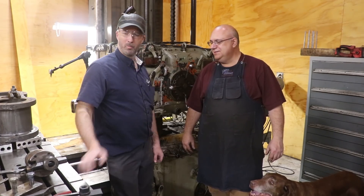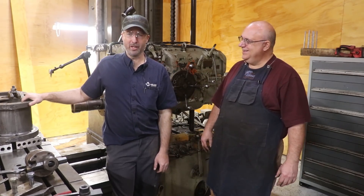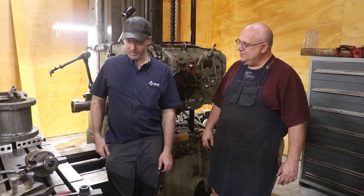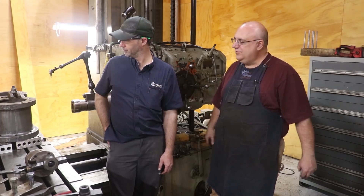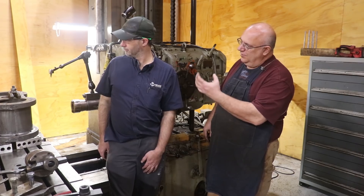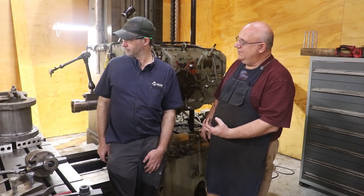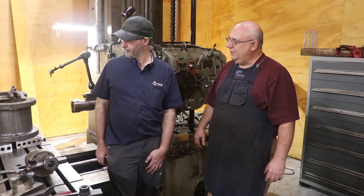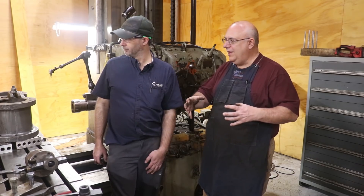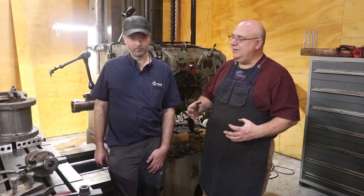So we're here today going to use my 47,000 pound boring mill to punch a couple holes out in this steam chest off the stoker engine. This is a cylinder head actually. If you've been following my restoration on this stoker engine, you'll know that when we took this thing apart there was some pitting on the inside of the cylinders. The goal here is we just want to basically bore out and get it cleaned up. The size is not super critical, although we'll probably shoot for some nominal size to keep them close to one another. According to the specs, I've got three sixteenths to a quarter of an inch that we can actually bore this thing out oversize and still be within the specifications without having to sleeve it.